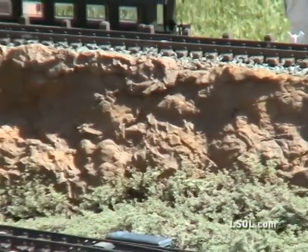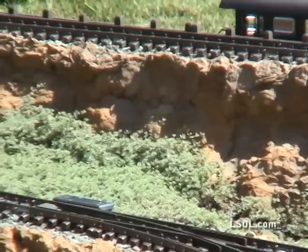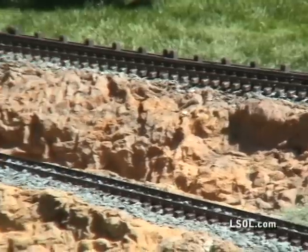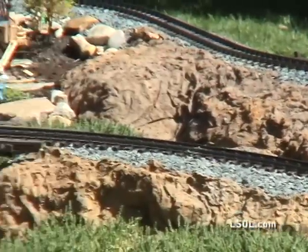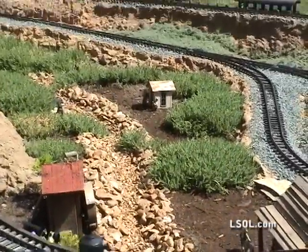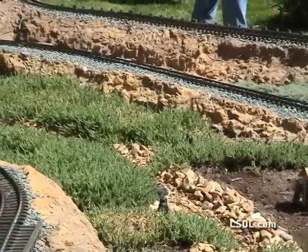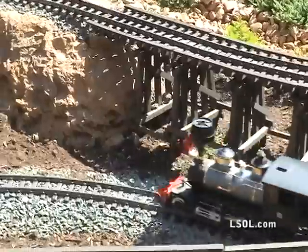And while the mortar was still wet, we pressed wrinkled aluminum foil against the mortar and let that sit and dry, and then peeled the aluminum foil off the mortar 24 hours later at least. Prior to putting the aluminum foil on the wall, we coated the aluminum foil with vegetable oil, PAM, something like that, non-stick, so that it didn't adhere to the mortar.